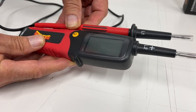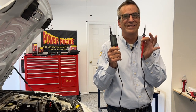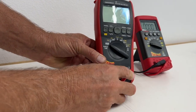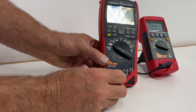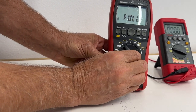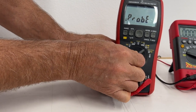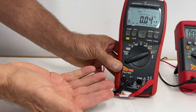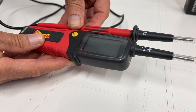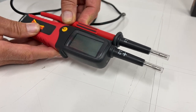The VT750 also has one fixed probe on the tool's housing with the second two-pole tester on a short lead. Most multimeters have removable leads with different connections — you could inadvertently put those leads in the wrong connection and get a false reading. Most multimeters also have a large selector dial with lots of different settings and test modes, so you could accidentally set it in the wrong mode and think you're reading zero when you're not. Having a tool with fixed probes and no mode selection — it just reads voltage when it gets voltage — guarantees reduced risk.